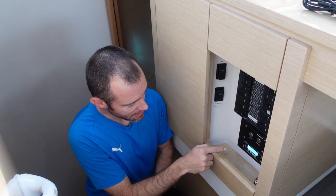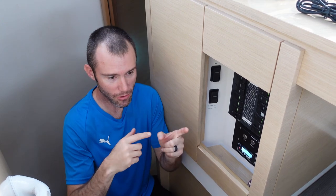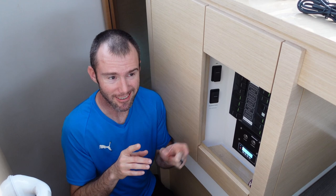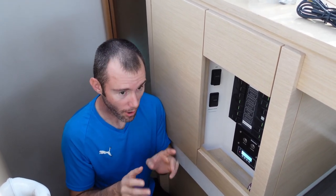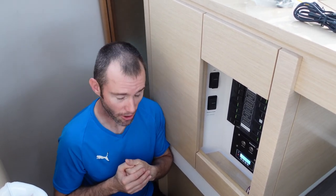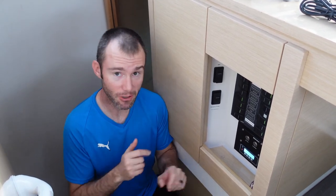So I think there's two options. There's settings in here that I can adjust to tell it when to close the solenoid valve, so I'm attempting to mess with some of those settings. And then there's also a wiring possibility that I might swap which side the wiring to the relay goes. So we've got to test both of those things. We're going to start with the easiest one, and that's playing with the settings inside the controller. I think I had the relay programming swapped, so just change that around. Let's try this one more time and hope that I've got everything programmed correctly.